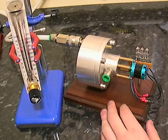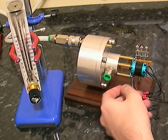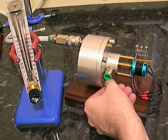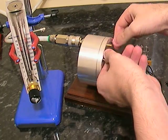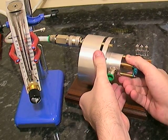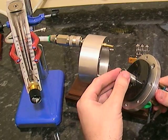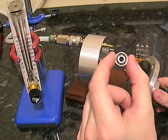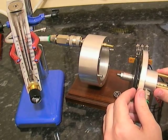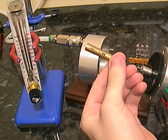Let's clear everything out of the way and open it up so you can have a look inside. We've got a load of extra spacers put in, and here are the ceramic hybrid bearings — they spin really freely. We've also got the carbon fibre discs, just the three of them. The air is injected in two places, and we've got the injector over here with only two of the nozzles working — all the other nozzles are blocked.